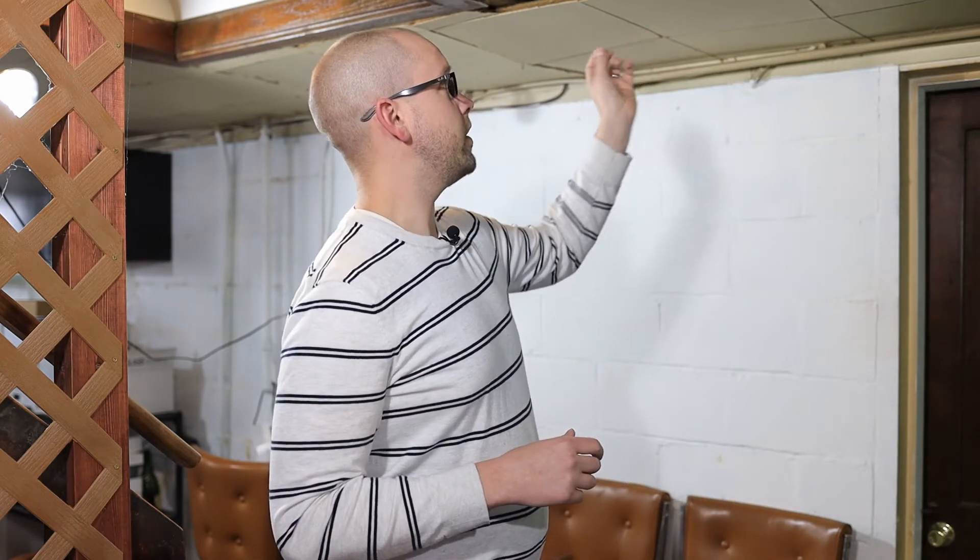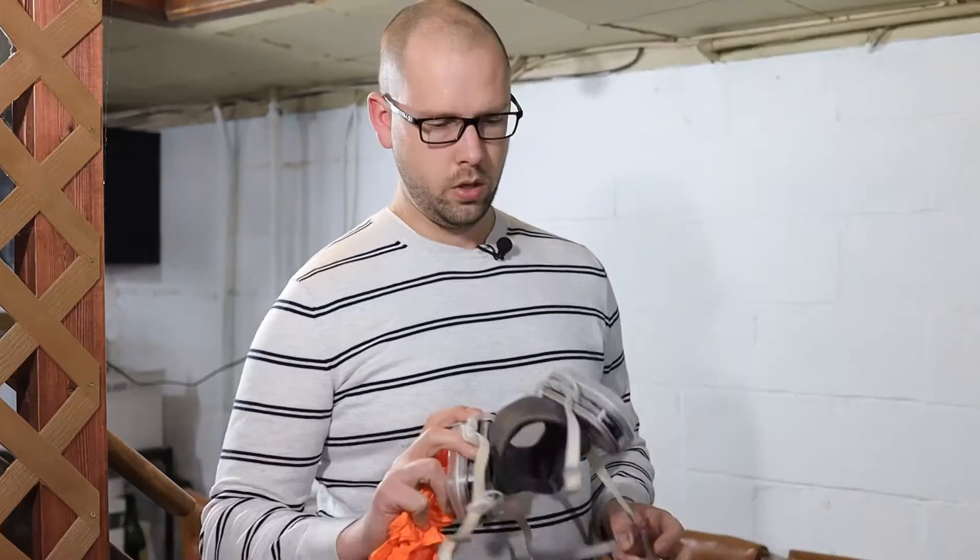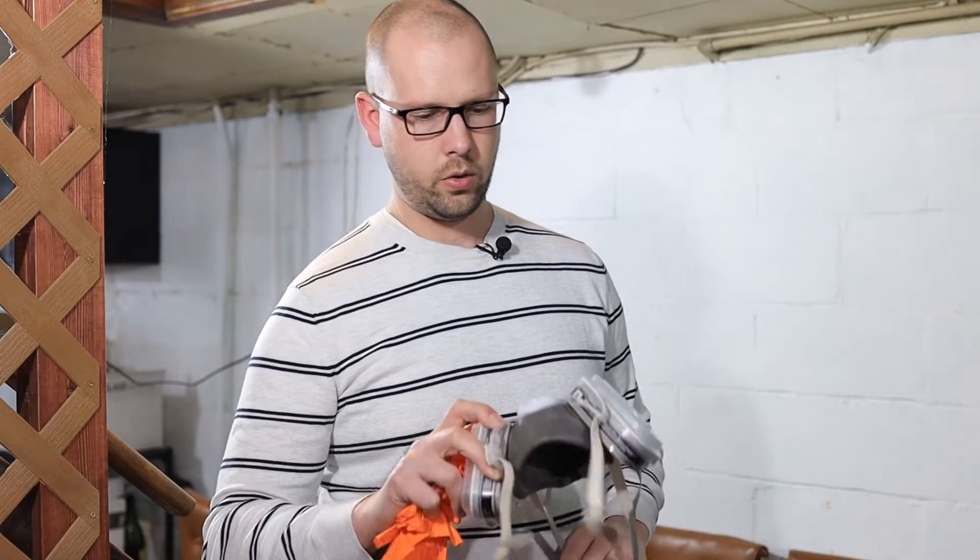If your material is visibly loose, take a spray bottle of water and dampen it a little bit before you pull the sample so you're not creating dust or particles floating through the air. I'll put a link in the description for everything used in this video including the $25 asbestos test. This is a pretty good 3M cartridge-style respirator that I use for woodworking projects. We're going to put that on and then put on some rubber gloves when grabbing the samples.